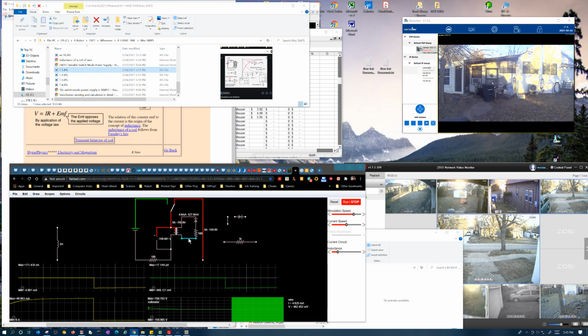And then, of course, voltage is equal to L dI/dt. But because the current would be so much higher, you would expect the voltage to change faster, right? Since it's still got a finite amount of energy, you can discharge that energy faster with a higher current and therefore drain the energy out of it in 1/10 the time. So I'd expect the dI/dt to be higher.